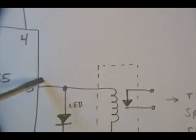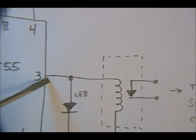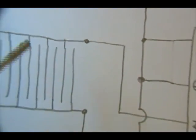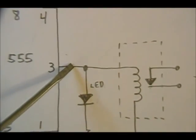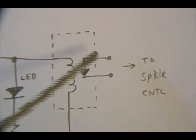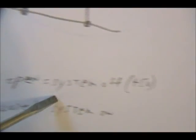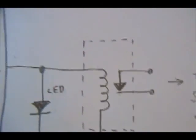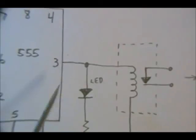That's the duration that this will remain positive. I thought about it — it doesn't really matter that much the duration, because if it's raining, there'll be water here and it'll stay here for a while. A few drops will be there, and as long as there's water here, this will be triggering continuously, which will open this normally closed relay, which in turn will turn the system off once that relay opens. It's a very simple circuit. I believe it's called a monostable multivibrator — or I should say it's running in a monostable mode, which is the single pulse of one duration, whatever you decide these components will be.